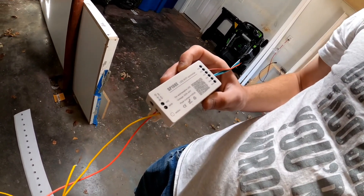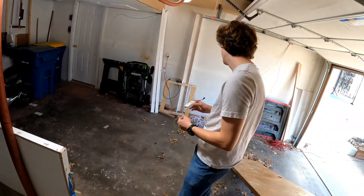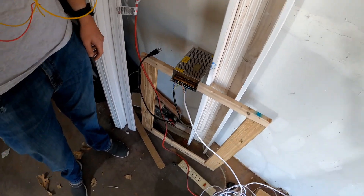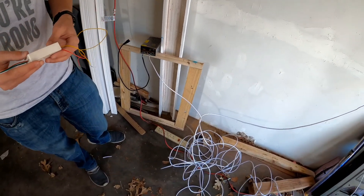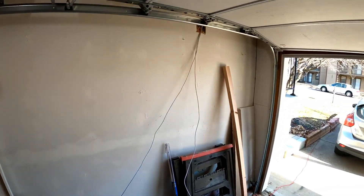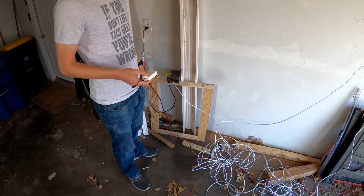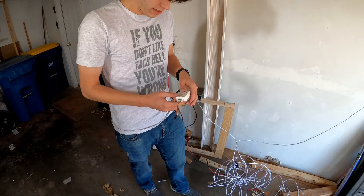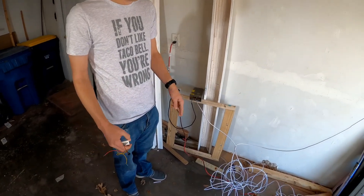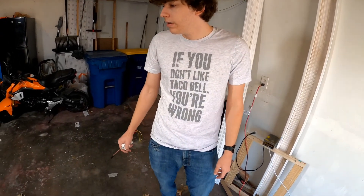It just takes 12 volts. My power supply is rated for around 300 watts. Then you use a normal Cat 6 wire — I used Cat 6 because I had to run network wire up there anyway for the cameras, and it can eventually go down to the basement. You hook this up to the actual LEDs and then run 12 volts again from the power supply to those two lines on each strip of LEDs for their own power.